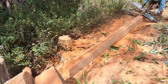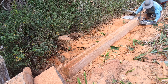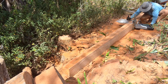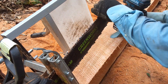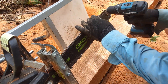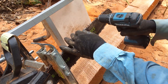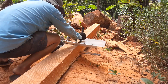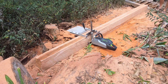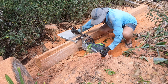Finally, we set the horizontal jig to a depth of six inches and make the last cut. I'm hoping to use this massive hardwood beam in a timber frame pergola in our front yard. When cutting seems to be slowing down, that's probably because it's time to stop and sharpen the chain. A standard sharpening guide doesn't work for the strange cutters of a ripping chain, so I use my drill like a Dremel freehand — it's not great, but it works. Now we can finish cutting the 6x6. It's hard to cut this close to the ground without running into obstacles, so I come at it from the other side to finish.